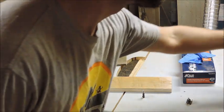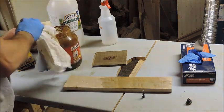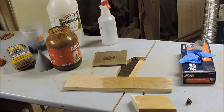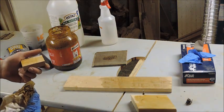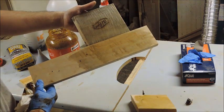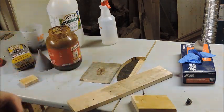Woods like pine are going to have a totally different color that they turn. They'll tend to just turn to kind of a tan-like color. It's not particularly exciting. Woods like oak, on the other hand, this is actually cedar, but I don't know what will happen here. Woods like oak will actually turn black, so I usually don't use it on oak because it's just a little too extreme. But maple is one of my favorites, and so I expect that the beech wood, since it is very, very similar to maple, is going to react in a manner similar to what we see here.